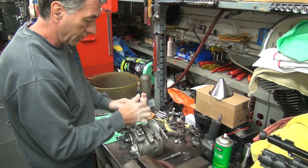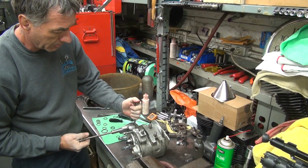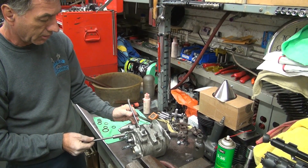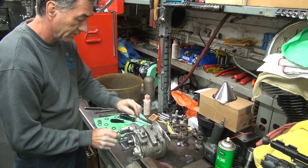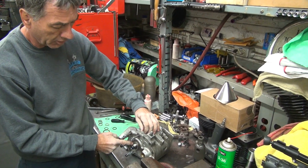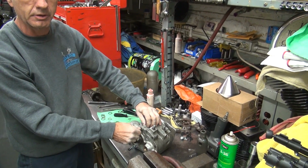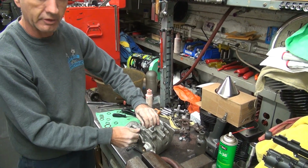That's why you've got to put it together a few times to find out what your minimums really are. What you expect things to be and what they turn out to be are not always the same. And it's important that you put enough bearings in here so that this is centered, because if that thing cocks a little bit, it changes numbers a bunch. So we have all the bearings in here right now.